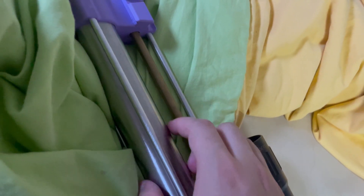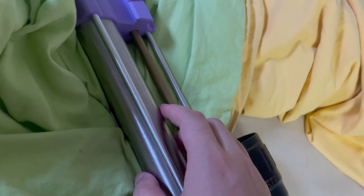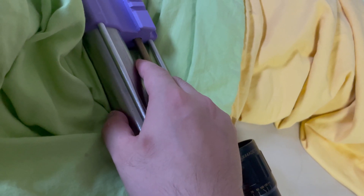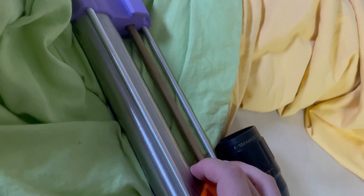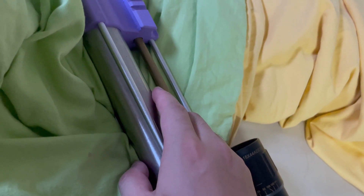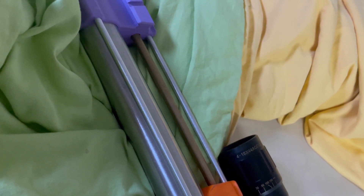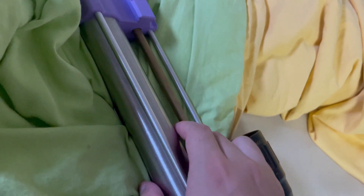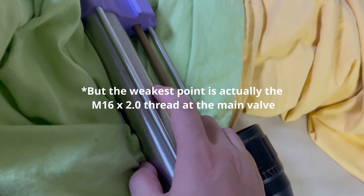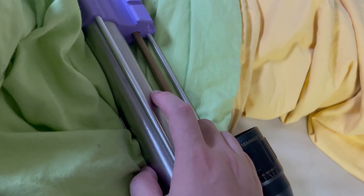This is the air vessel. I use this stainless steel extension pipe here, but stainless steel extension pipes are very difficult to buy in the UK, so you may want to replace it with copper pipes. I initially wanted to use copper pipes, but I'm very bad at copper pipe soldering, so I just used this stainless steel pipe. This one is 3 mm thick, and at a safety factor of 4, it will hold at least 5 MPa of air.